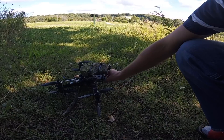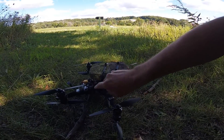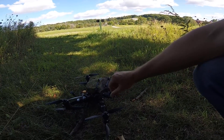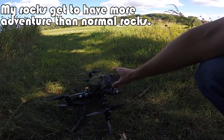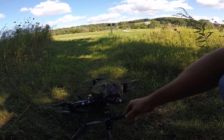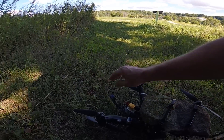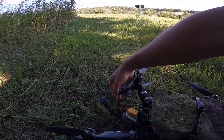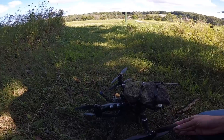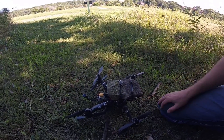So you saw the flights with the 5-pound weight on it — it's kind of docile, but it looks pretty critically damped to me. There's just a little bit of vibration, and I think it's because the weight is hanging out like this, which just amplifies any vibes. I would guess that's not going to show up on the top since it's kind of soft-mounted there — there's a little bit of flex to suck up any vibes. I've taken the 5-pound weight off. Now we have this rock, which emulates about 1.43 kilograms. The camera supposedly goes up here at 1.5, so we're just trying to have an analog for that. It's not like I have perfect props — these props are not in ideal condition, a couple are broken. A lot of times when I do a tune, I'll leave that kind of stuff because I don't necessarily need perfect props for tuning — I want them to be decent, and these are decent. I think somebody would still fly with these.